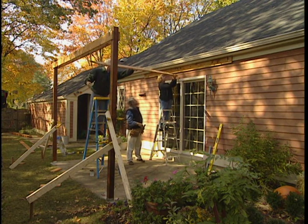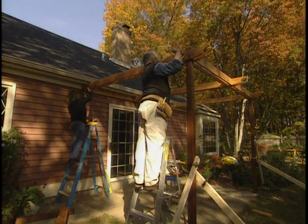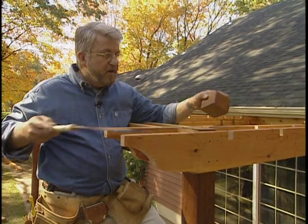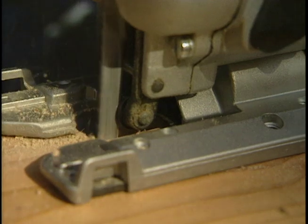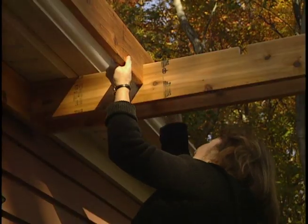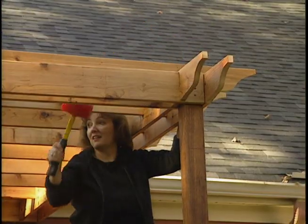Curved ends completed, Dennis and I next cut the numerous notches that will allow the beams to interlock with one another. Now it's time for some assembly. If we've measured and marked carefully, the layered interlocking beams should all fit together like the pieces of a giant puzzle. We purposely left our support posts long — now it's time to cut them flush. My tool of choice for this? My trusty Japanese handsaw. Now for the third and final layer of crossbeams. We cut these interlocking notches a bit shallower so the beams will sit higher and appear more prominent. Joanne and I are the workhorses here — I love the way this is fitting. Then Dennis comes in to help out with the last few, and we have a ceremonial passing of the mallet before we call it a day.